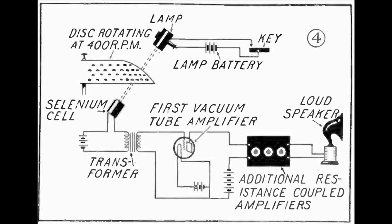This mysterious instrument and the history surrounding it piqued my interest. I wanted to hear it for myself, but it seems to have been lost to history. However, pictures and even circuit diagrams have survived, so I decided to build my own luminophone. This is what Matthews' luminophone circuit looked like. Each key turned on an incandescent bulb directed at a particular ring on the metal disc, which was spinning at 400 RPMs.